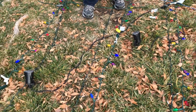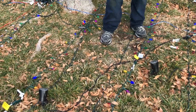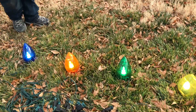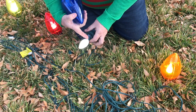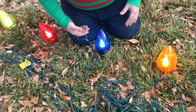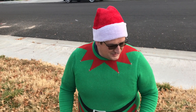These are little spotlights — again, liquidation sale after Christmas. If you're not hearing a common theme here, it's rather amusing what kind of deals you can get if you're a little creative. These spotlights just kind of light up and make the tree look completely different by illuminating the whole thing in blue before I start lighting up the other lights in the tree — it's a neat effect. These are also liquidation sale after Christmas. I'm just using standard LED bulbs, which are actually quite powerful for this. If you are swapping out any bulbs in your setup, make sure they are dimmable — the ability to ramp up and ramp down is really important. When I do sweeping effects back and forth it causes a lot of dimming, and your normal non-dimmable bulbs will be destroyed almost every single time. Make sure the LED lights you put in are capable of dimming.